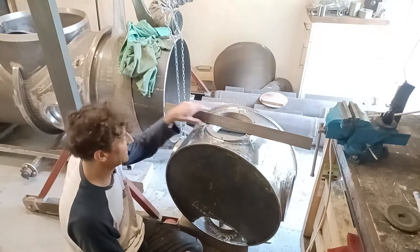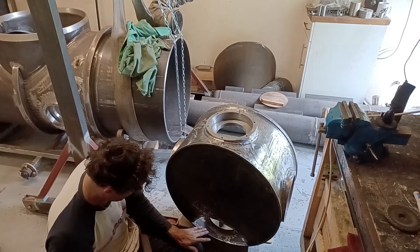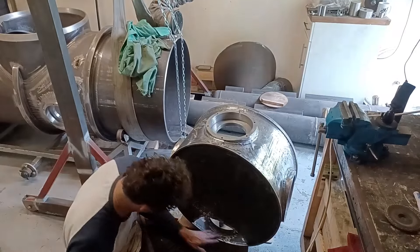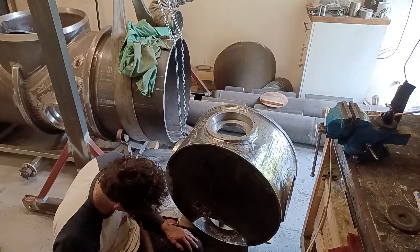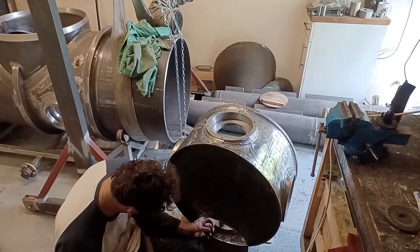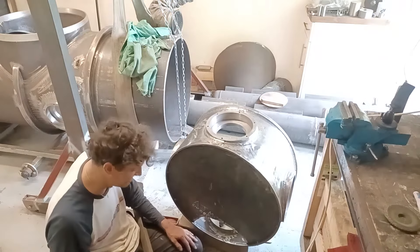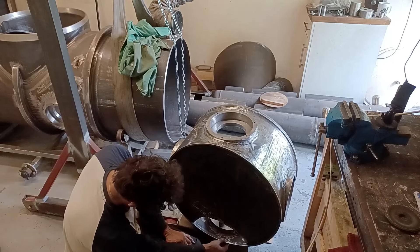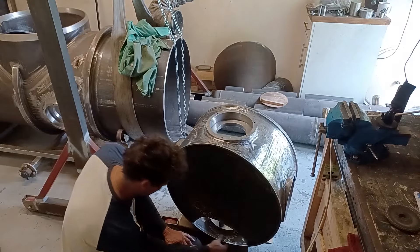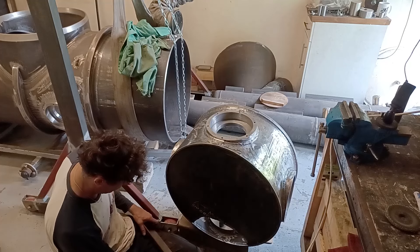It's taken an awful long time to make this tower, so I am not going to mess this up at the final hurdle. I need to weld along there. Now, this probably won't move, but probably isn't good enough. I'm going to make an external brace just to give it a bit of stiffening on the outside to hold this shape. Because when I weld in here, it'll pull it, and this might just pull in a bit and pull out of shape. I don't think it will, because it's welded on the other side - it's actually welded all the way through. So I'm going to make a thing out of this piece of angle.